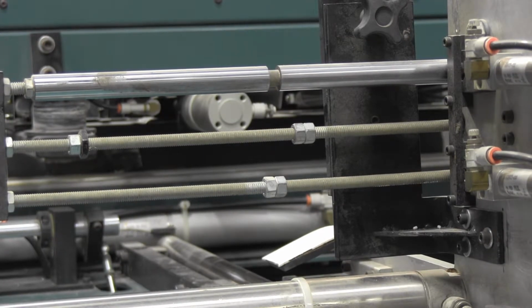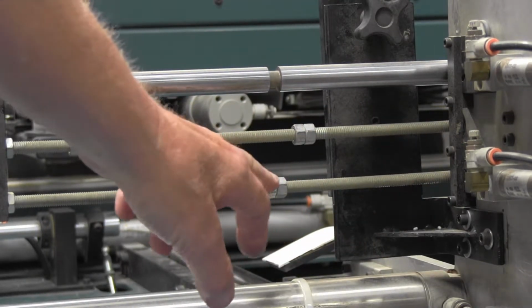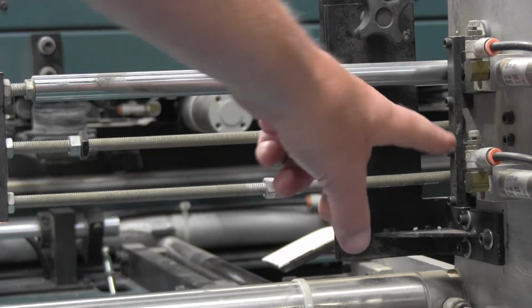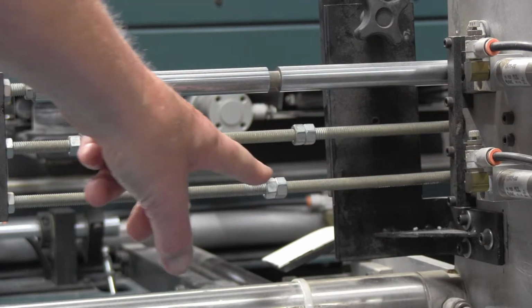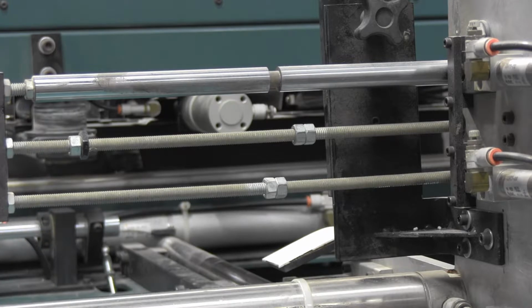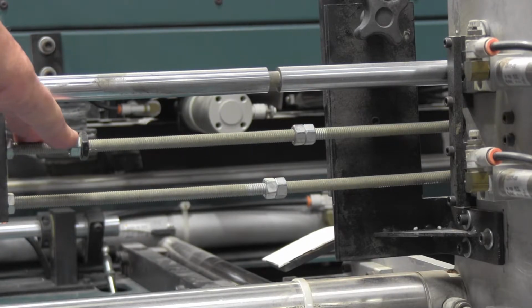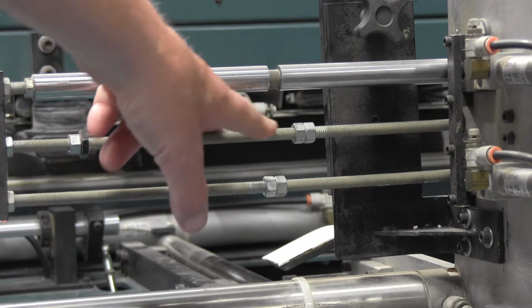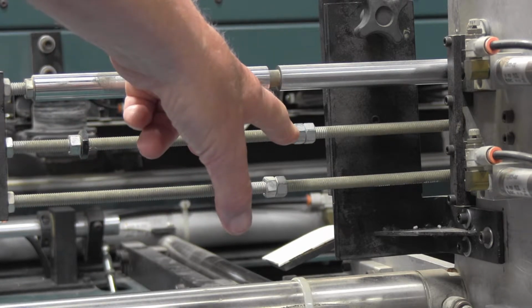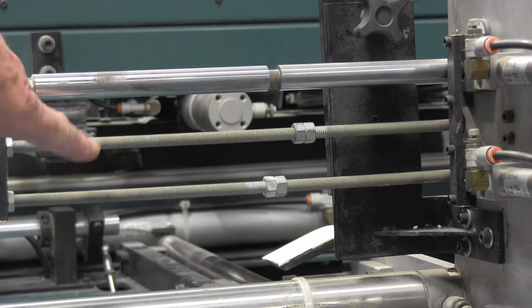When it shifts back to do a deadbolt, right now it's on the bigger stop on this one. This will be the location for the deadbolt. This yoke will plunge out. This set of nuts goes down to contact the yoke and stop it for the deadbolt location. The same thing up here. This is the stop for the lock bore, standard lock bore. This is the location for the deadbolt, and there's another yoke on the inside that it would come up against to stop that.